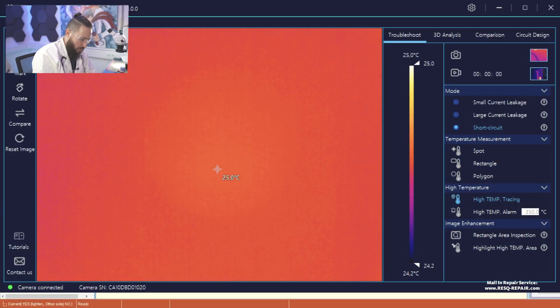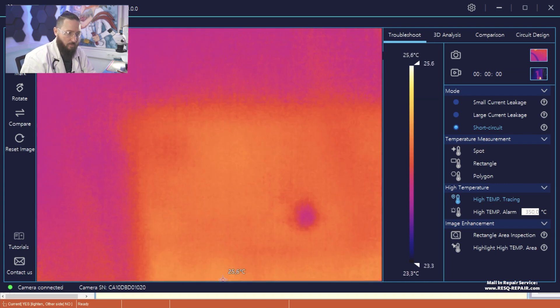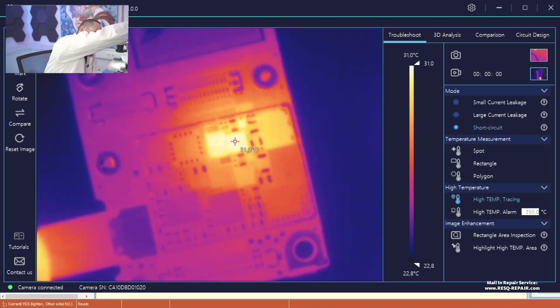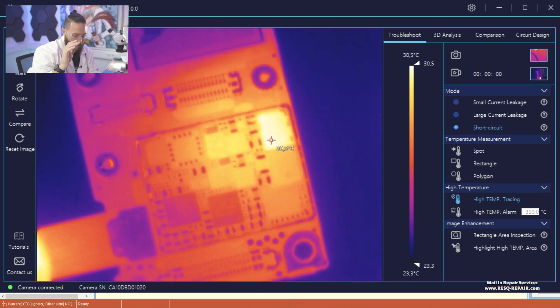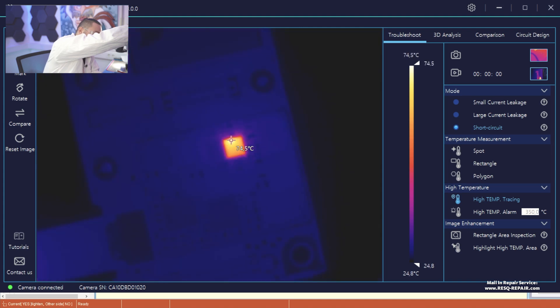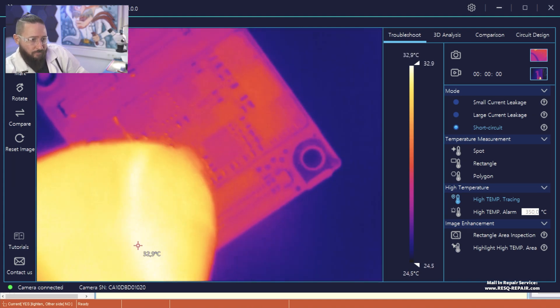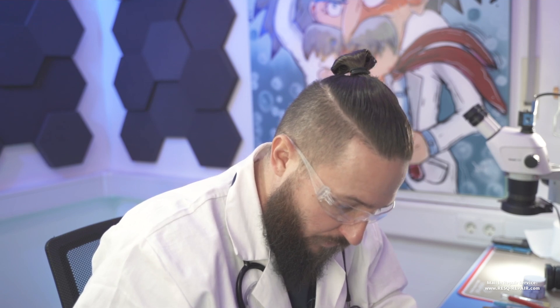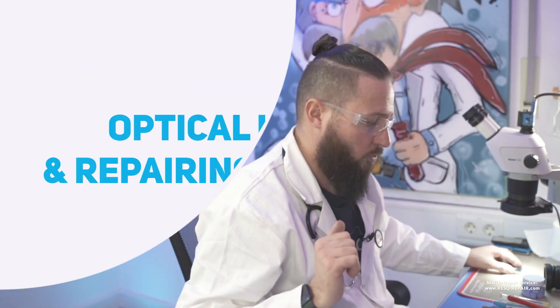We have the board again. We go right to the backlight circuit here. We have issues with the backlight driver IC. We could do it once without the shorted cap. Here you can see the diode normally only lets the voltage go to one side, and if it blows up it can go to both sides — and there we have the issue. Now the backlight IC has blown up.